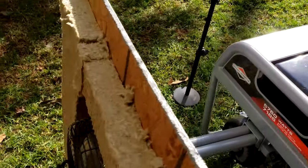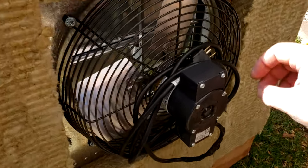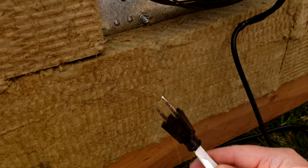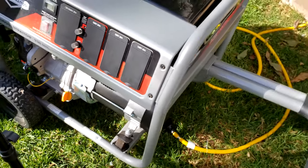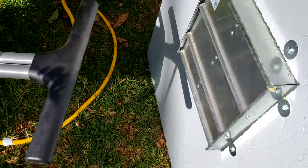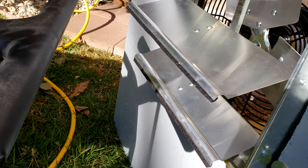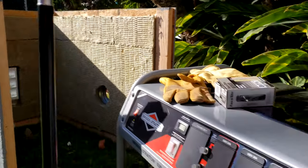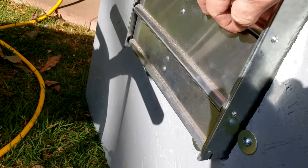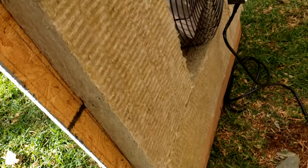You might ask, how am I going to get all that warm air out of the box? Amazon to the rescue — I bought one of these 800 CFM electric fans, pre-wired 115-volt. All I had to do was wire up a three-prong plug that plugs right into the generator when it's running, so it's kind of self-powered. It's an exhaust fan — these louvers open up when it's running and are very well sealed, so critters won't get in. There's also a screen on the other side, and of course all insulated.